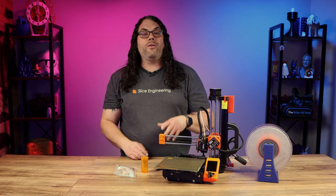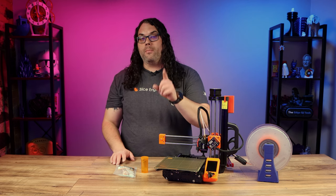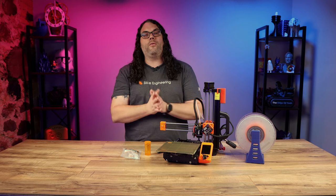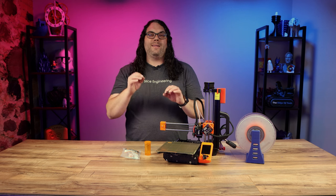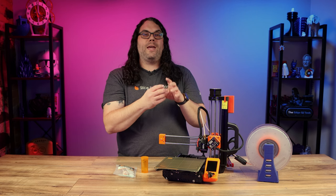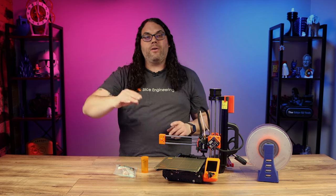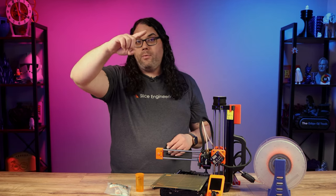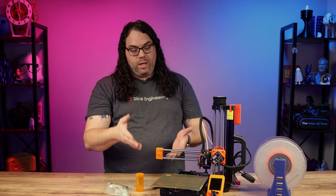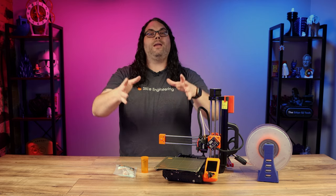You've officially installed your Copperhead kit for the Prusa Mini from Slice Engineering. A couple quick tips: number one, when pushing the thermistor and heat block out, be very careful — it can take a while and you don't want to break any wires or damage anything. Number two, before finishing make sure the nozzle is lower than your auto bed leveling sensor, otherwise you'll never get a good first layer. All I did to lower it was loosen those three screws, pull it down until it looked right, tighten them back up, and run calibration again — and I got really nice layers. If you're looking to buy one, check the description below for an affiliate link to Slice Engineering.